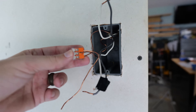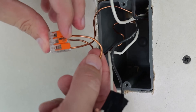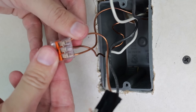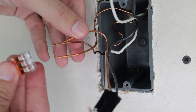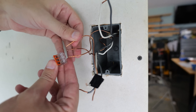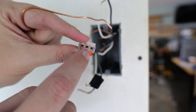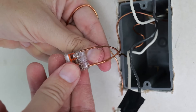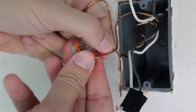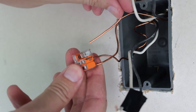In this case I'm using these lever connectors — these are the WAGO 221s. They're super DIY friendly and easy to use. They just have these levers that flip up, and when those levers are flipped up the wires are free and the WAGO can be removed. Just as easily as it's removed, it's just as easy to install by inserting the wiring into each one of the ports. So I'll just install that one right there and once it's in place I'll flip the lever down.